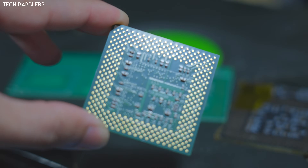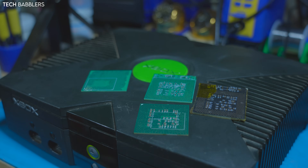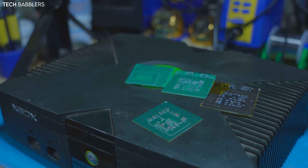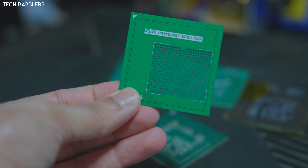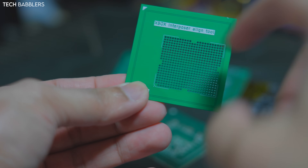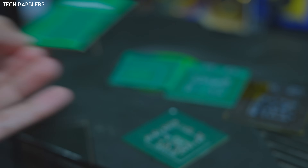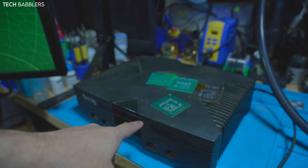It's just a tighter profile, a little more centered, so when you sit it on the motherboard it's not off to the side. I have these pre-populated, but all of these interposers use the exact same components — maybe moved around a little bit, but same exact stuff. The benefit of using Frank's is it comes with a nice alignment tool, which you can purchase. It's called an Xbox interposer align tool — each BGA pad on the motherboard is basically see-through, so you put this on and align it, which makes life easier.